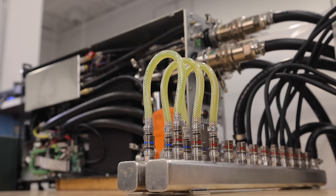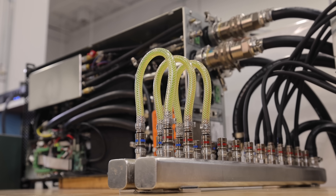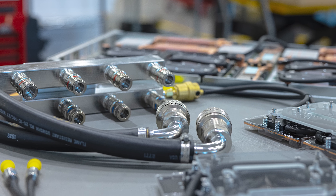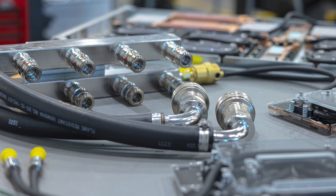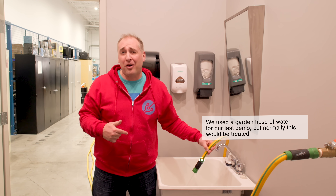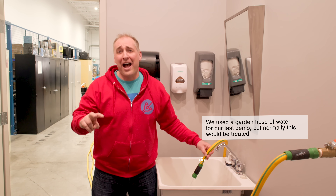It's not just the physical stuff — the hoses, fittings, manifolds, and CDUs. There's also just the liquid that's used. The liquid in some of these loops is actually treated and has things for anti-microbial, anti-corrosion, and all those types of additives. Those additives can vary based on the system and vendor, and they can work differently depending on what you have in your loop because they can interact with different components differently. So you have to go test all this stuff together — that's why this station is really important.